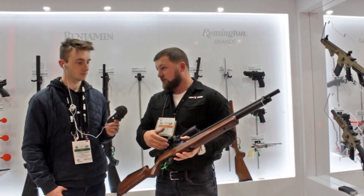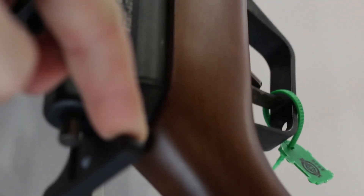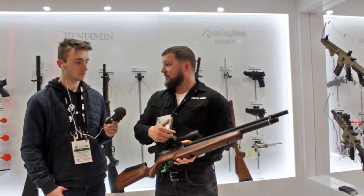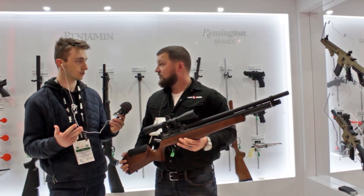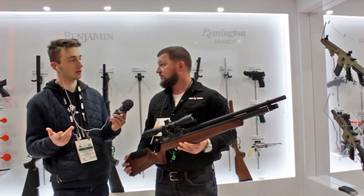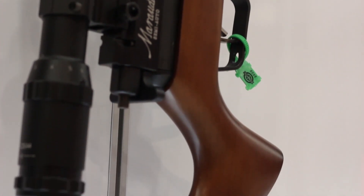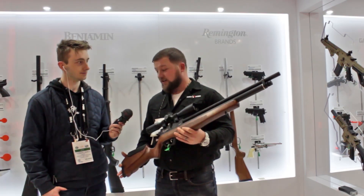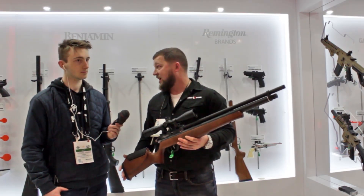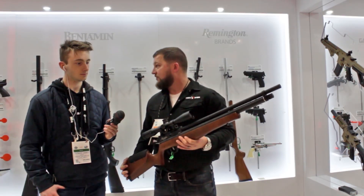The hammer and the bolt are independent. The bolt flies back independent of the hammer — the valve sends the bolt back and the air that comes up shoots the pellet out and also sends the bolt back. It's an actual true semi-automatic single-action — not a double-action trigger. The trigger has a disconnect, and that's what allows us to get the semi-auto out of it. As far as velocity, you're getting up to 900 feet per second for 60 shots; out of the factory it'll shoot around 880 to 900, which is the sweet spot for it.